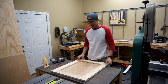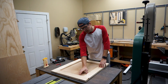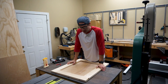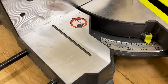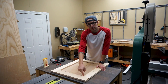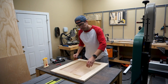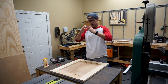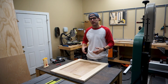Now that we've got all our outside trim pieces done, the way I'm doing the doors — I'll insert a picture here of the style — I'm going to start at this corner and come down to this corner. Something new I just found out: there's actually a setting on a table saw that will give you the perfect angle you need. It's 31.6 degrees — that will get you from this corner to this corner. At this point you need to reorient your door, decide where your top is, look at your project, decide how you want your angles to come up, match those up, and make sure you have the right side. It's easy to just start nailing, but you need to pay attention to how you want your doors and what side you want your hinges on.